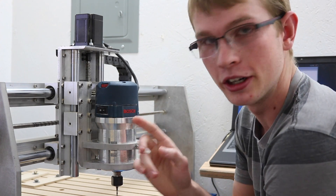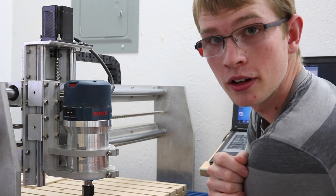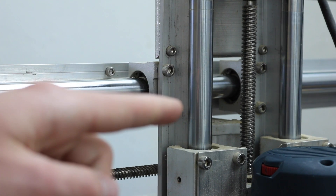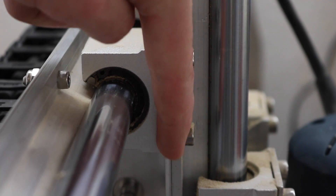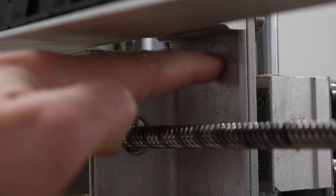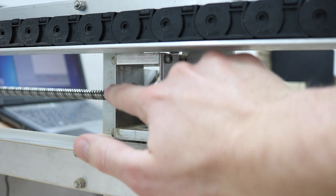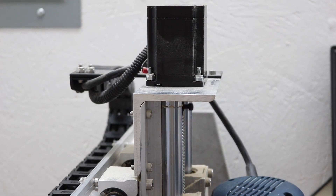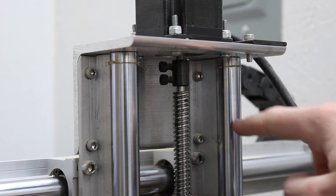There's a lot going on here — I counted 116 drilled holes and 72 bolts in just the part that is moving right now. The x-axis bearings are bolted directly onto the z-axis rails, and those bolts go through the z-axis rail support and into these bearings, with a piece of two-inch angle between them. On this side you can see the bearing and that piece of two-inch angle — this leg of the angle has been trimmed down to only three inches long, and the purpose of that whole assembly is just to hold this Delrin nut. So that's the x-axis drive. At the top there's a piece of 3x3x¼ inch angle holding up the motor and also helping to keep the rails spaced correctly.